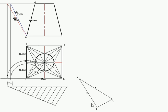First part of development: E and A are the two lengths that we worked out as true lengths. E, we worked out the true length as 67. A, we worked out the true length as 74. We know what the length of BC would be because it's on the base, so it's 32 and a half. So from point A to point B, we measure the E length, which is 67.